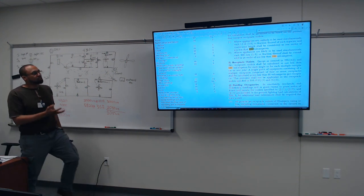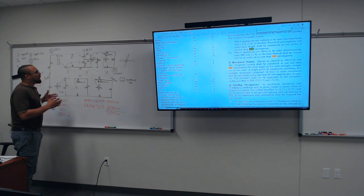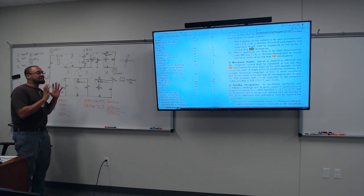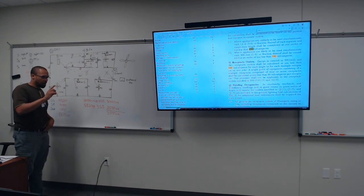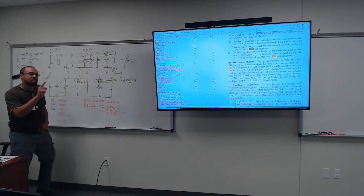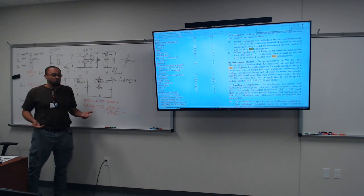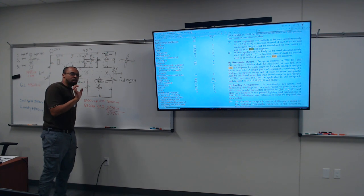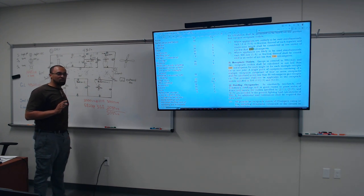So with that magical number I just read out, 180 VA, we're going to determine how much current, the calculated part. This is the calculated number that you use to calculate. It's not saying you can't go over 180 VA. So if I have one receptacle, what is the voltage in our home? 120, right? All receptacles are 120. If we have 180 VA, which is 180 watts, what is the calculated amps for each receptacle? Ohm's law: watts divided by voltage. And that value is?